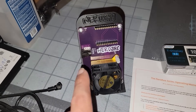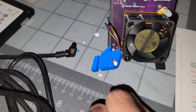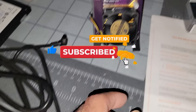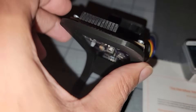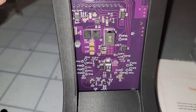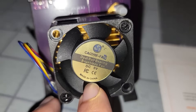It does require a 5-volt 4-amp barrel plug, 5.5 millimeter. I have the right barrel but only a 5-volt 2-amp power brick connected via USB Type-C, so I need to make an adjustment there. This is a custom 3D-printed stand for the Nerd Axe. You can see all the various components on the back side, as well as the mounting holes for the cooler to keep the BM1366 chip nice and cool.